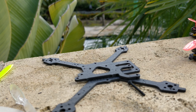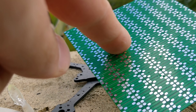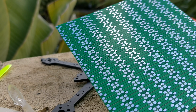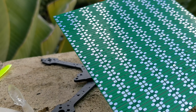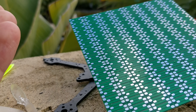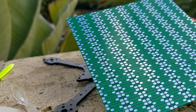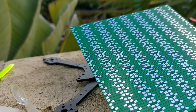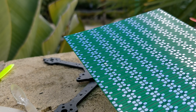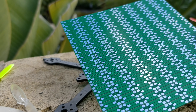For people getting their orders: I forgot to pack the race wire in orders numbered 705 or under. I taped it to the inside of the package lid — please don't throw away the packaging, check the lid, it's in there. I'm also going to be discontinuing the mini race wire because there's honestly no point. I don't recommend the 080x builds — the 2S 1103 builds are not expensive and are just so much more fun to fly. Even on 1S, just get the 1103 motors, run 1S, enjoy it, and when you're ready, move to 2S.